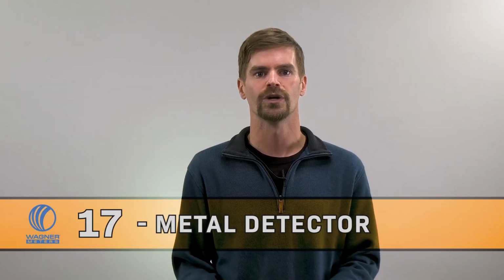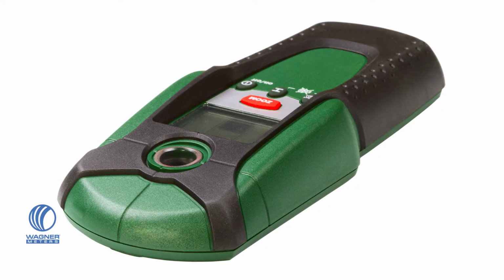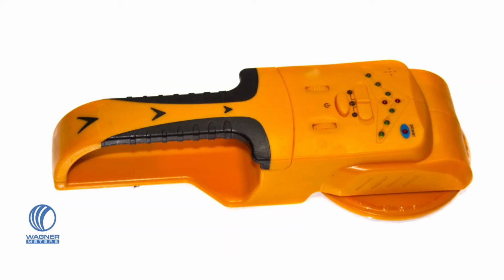No, you're not looking for buried treasure with your metal detector. You're looking for something that could ruin your treasures, namely your woodworking tools. It is of vital importance to keep metal out of your cutting surfaces, or you'll ruin blades, bits, and knives on your tools. A quick scan with a metal detector will let you know if there's a piece of screw or nail still lodged in your stock. You'll find out anyway. It's just nice to know before you ruin your tools.